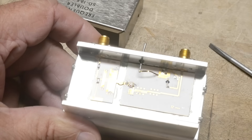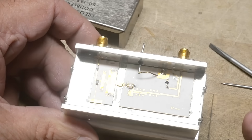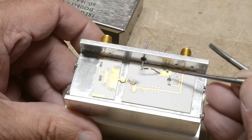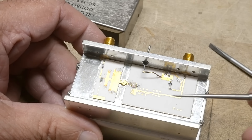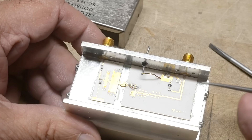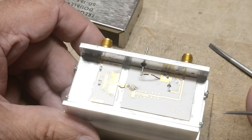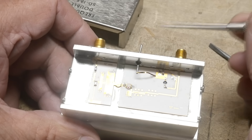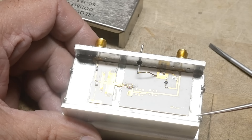This is an RF monitor. There's a coupler here with a weird little diode, a capacitor to ground, and a resistor to ground — pretty classic stuff. It demodulates the signal and turns it into a DC signal, giving you the amount of power coming through this thing.